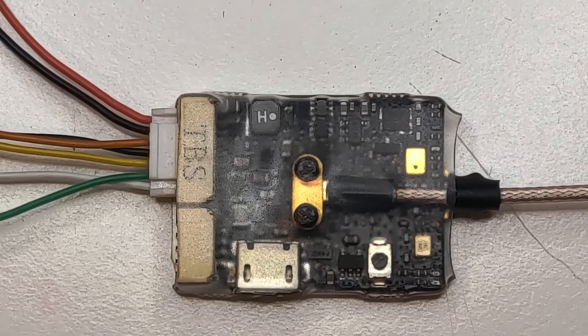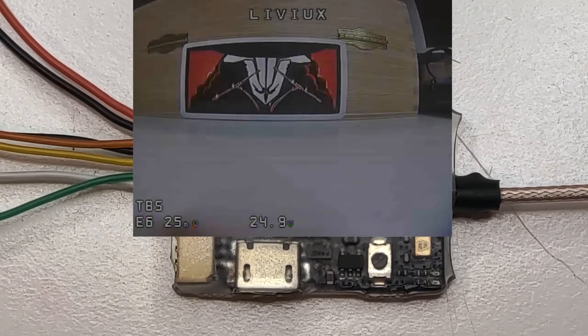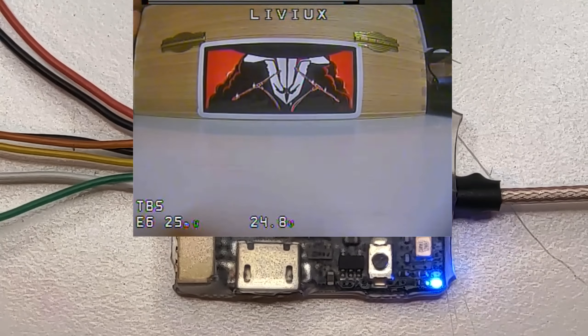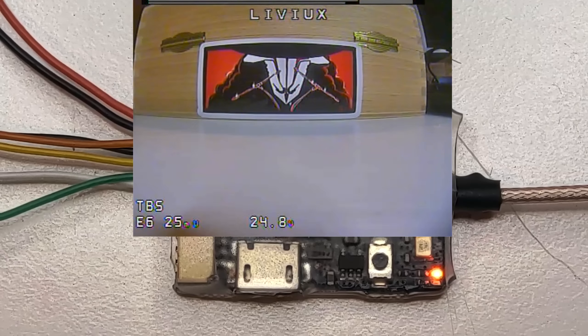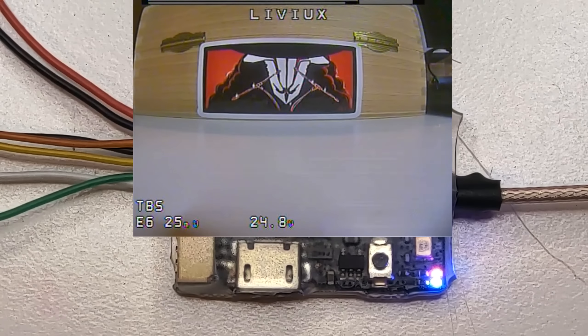The UFL connection is mounted in the middle, maybe because they thought it's a more robust mounting solution. There is also a PCB overhang where they used heat shrink for a more sturdy pigtail connection. This VTX is capable of 800mW like the ones before — you'd need to unlock it of course, details in the manual. The power levels are now 25, 100, 400, and 800mW.